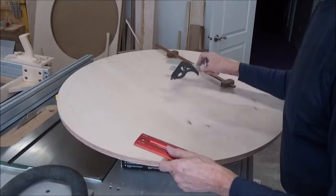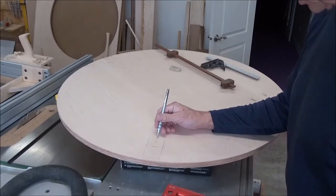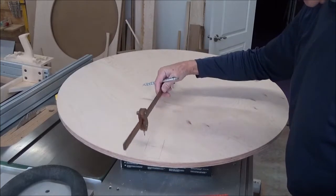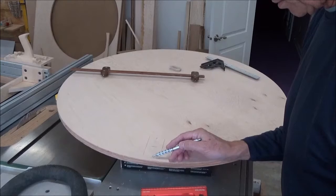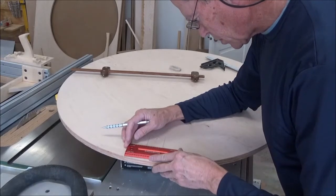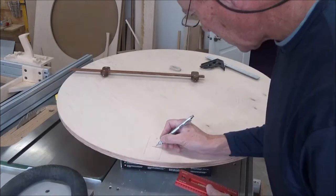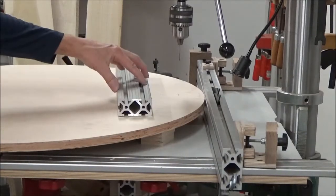I got the base apart and what I did was put shadow marks on these where the legs were before I took it apart — marked them so this will end up on leg three, leg two, leg one. I took my beam compass and made marks all the way around inside the shadow box here, about two inches from the outside edge. Now I'm locating a center mark right here.